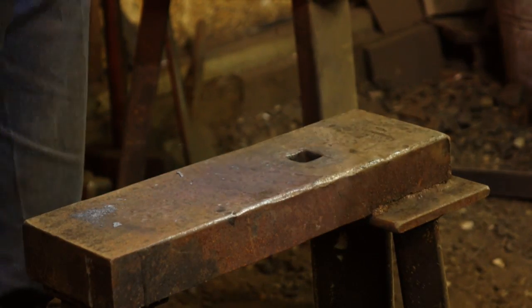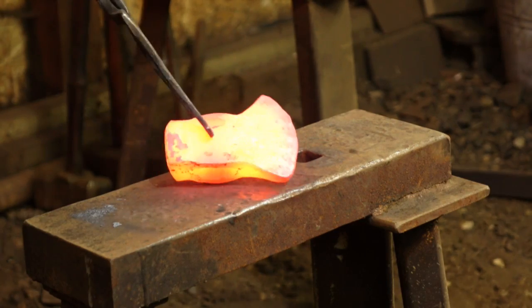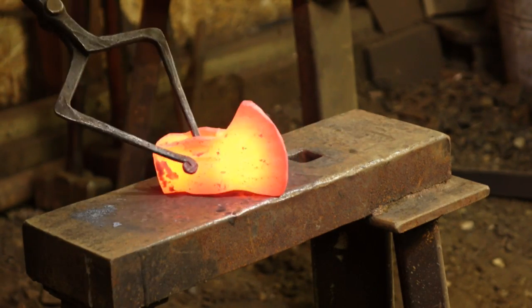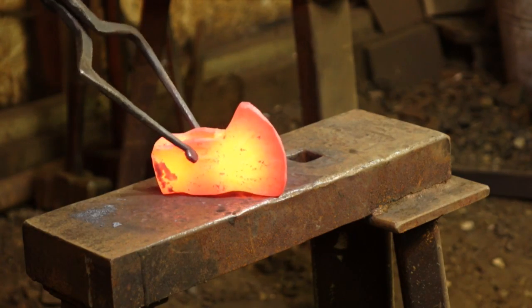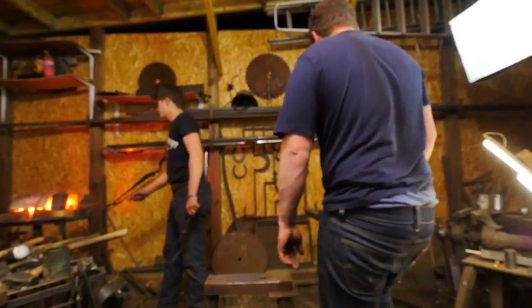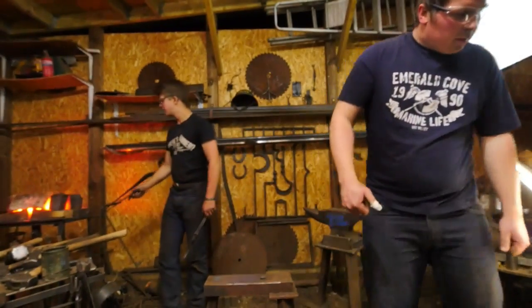Thick in there. I'm going to take some meat out of the body. I'm going to go in the eye from that one other side, right about there. I'm going to drift it as is. I'm going to push some of that tip down. And then that's probably going to be about it for the eye. And the way that we're going to do the final axe eye shape is by collapsing the one side of the eye by taking the meat out of the body.